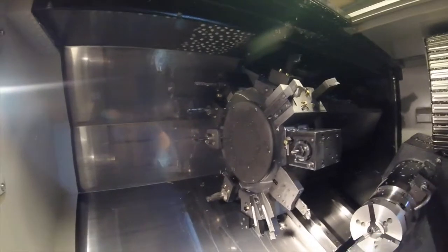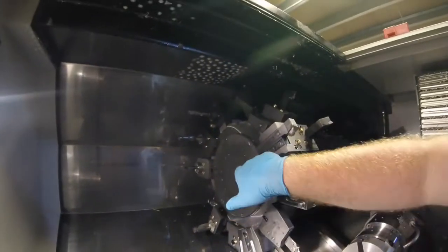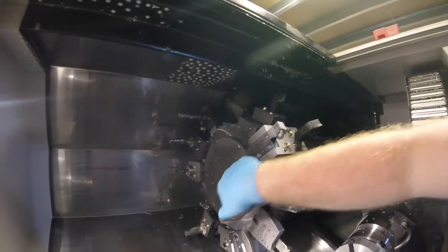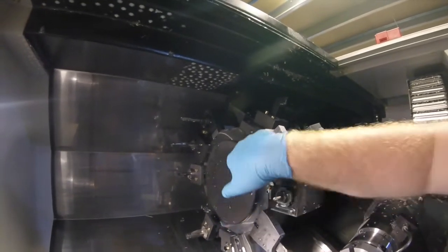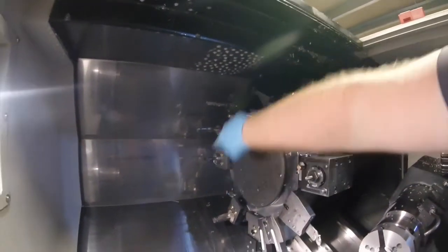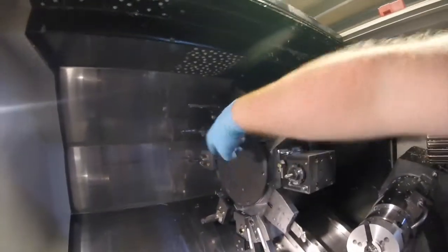It's actually quite simple to do. What you do is take off all these bolts — make sure you note or mark across one, because if you put this on the wrong way around you'll look like an idiot. So you just take this plate off; it's got a little rubber seal underneath and seven cap heads. Pull it off and you'll be able to see everything underneath.